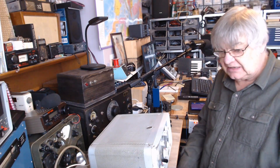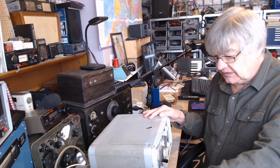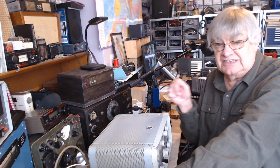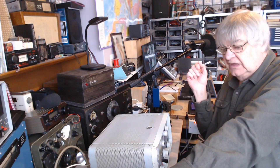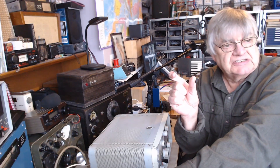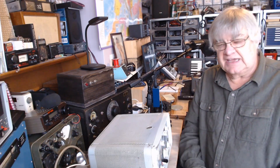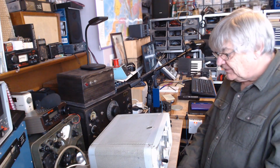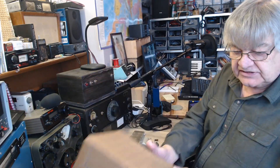I'm going to take some photos, I'm going to take the lid off the power supply in a minute so you can have a look in there. What I want to do is run it up and leave it on for a while and see what happens with the capacitors, because the original capacitors from 1966 — the power supply smoothing capacitors — really should be changed. Also the rectifiers — what's in there, is it a BY100? And also there are the flat ones with the four tags — one of those is in there and I'm going to replace it with a 1N4007 or similar.